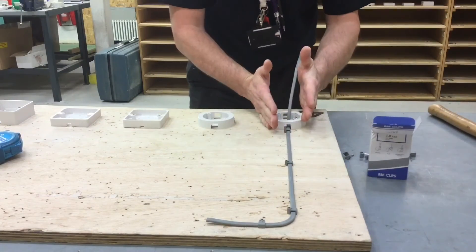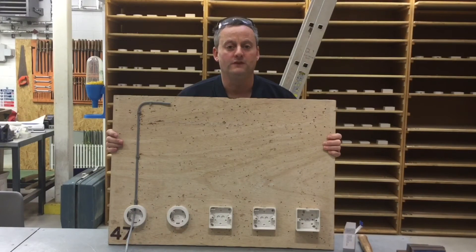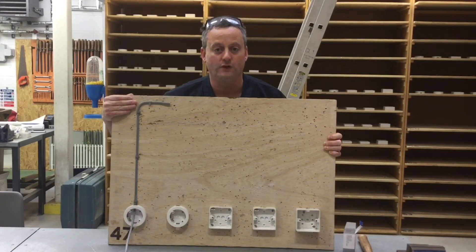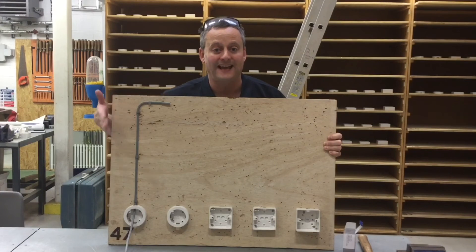At that stage, hopefully we've got the cable coming straight into the accessory with a nice smooth bend. So we've completed the first fix for stage one. We've installed the box, we've dressed the cable, the cable's flat to the surface, and the clips are positioned so that the nails run up the inside and round to support it horizontally. It's nice and flat to the surface with a smooth 90-degree bend. The centre clip in the real world possibly wouldn't be needed, but we've added it because this is the first time we're clipping PVC twin and CPC cables to any surface. So that's the basic clipping process we're going to use here at college in order to install our cables correctly to, in this case, a wooden surface.